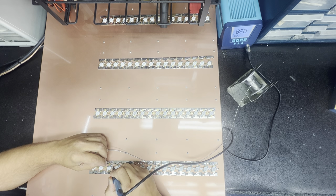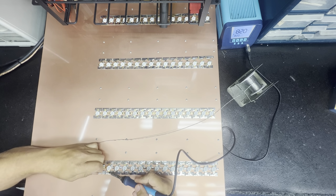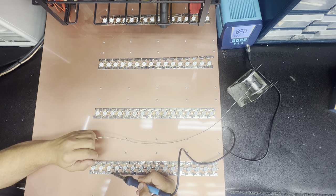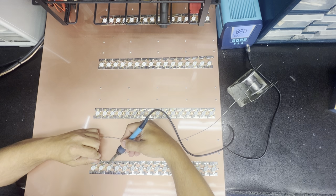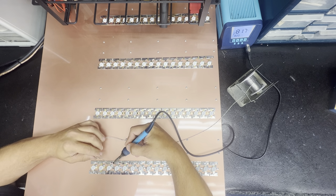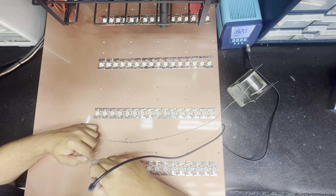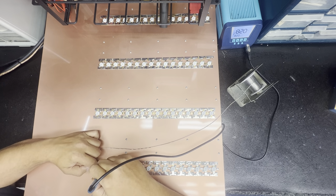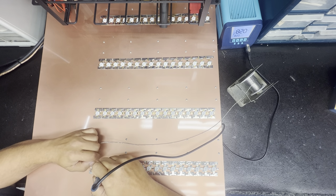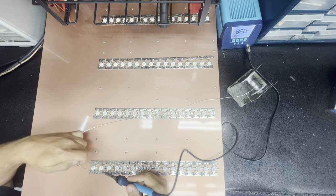And I don't like variable power supplies because they don't work right. I don't care who builds them. What ends up happening if you got like 15 units in a power supply, let's just throw that number out there, and you try to run wires and control them all with one variable, none of them power supplies are the same. They won't work. If that would work, you could take the variable and put it in the same place on every power supply and they'd all be the same voltages. Y'all know that don't happen. You see what I'm saying?